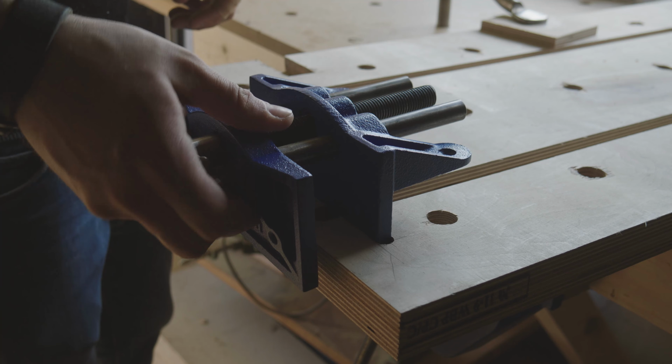The first step should be a groove, which is milled on the underside of the plates. For this I use a router with a 17mm groove cutter matching the C-rails. Set the parallel fence to 10 cm and off you go. I don't take away the complete depth with one milling step, but take several passes which plunge deeper and deeper step by step, so the results will be better and the milling cutter is less worn. I continue doing this until the rail is perfectly flush with the surface.